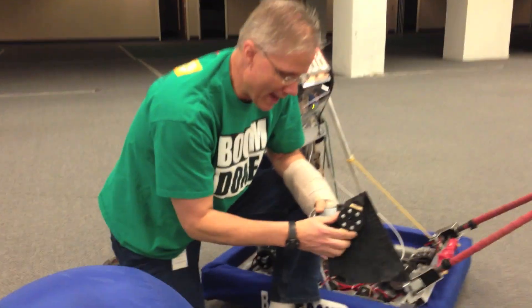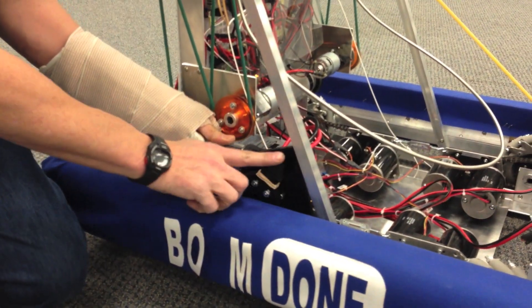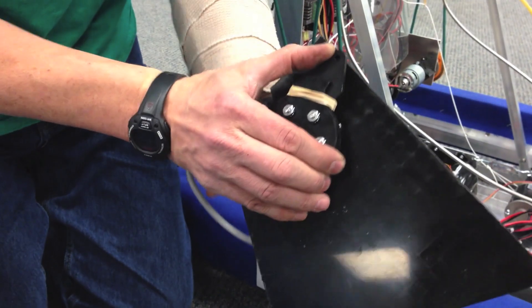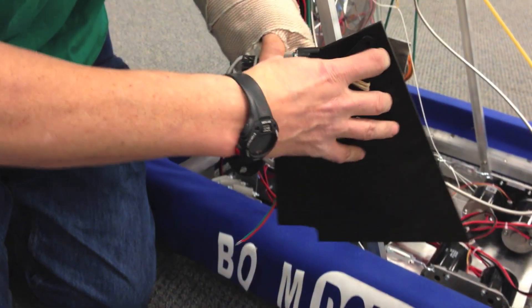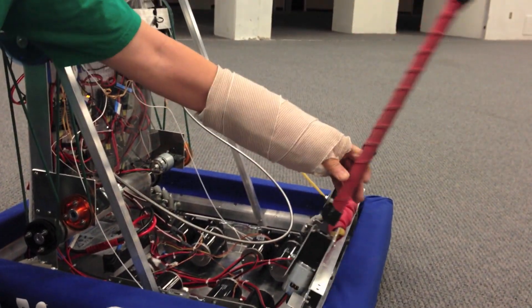You can kind of fake a pneumatic system with what we've done here. This is going to sit right in this part of the robot, and there'll be a linkage going from here up. It's essentially just a snowblower motor, but I put a mechanism on it so that when you drive, you only drive through these springs. It wants to be near a position, but not exactly there. So if somebody hits us, it springs out of the way and then springs back. The last thing you want is something out here held solid — somebody hits it and you just fall.